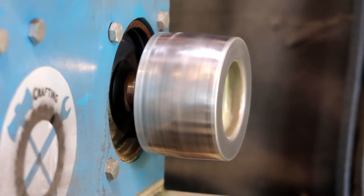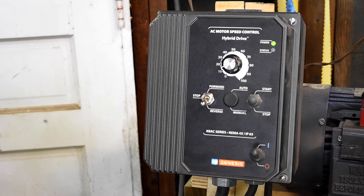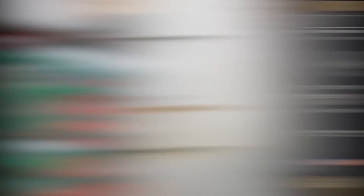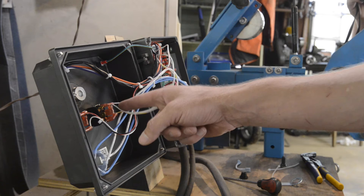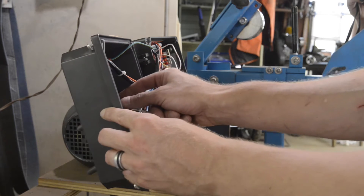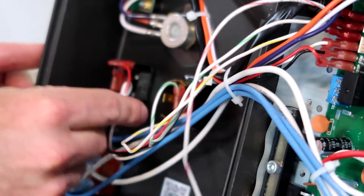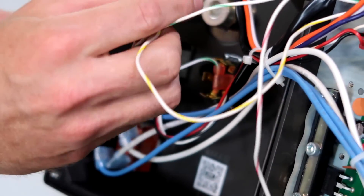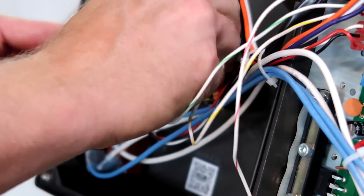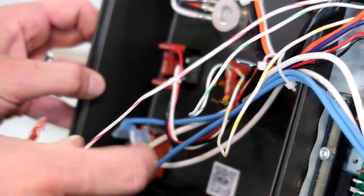And so that's going in forward for my motor. So what I'm going to do is swap my forward and reverse pins, and that should swap the direction of the motor for that orientation of the switch. Because these are really tight in here, I'm actually going to switch the wires on the switch itself since I have a lot more space to work over here. So I'm pulling off the red striped and the yellow striped — my top and bottom plugs — and then plugging them into the pins that their partners just came out of. So yellow striped is going up top, and red striped is going down below.